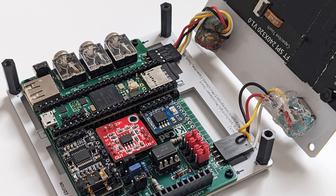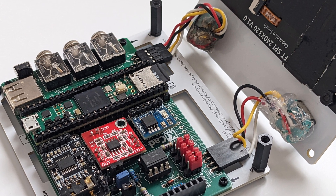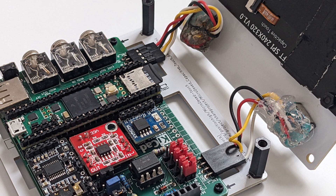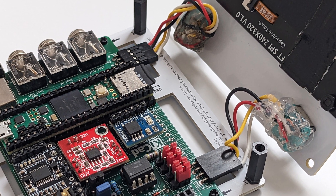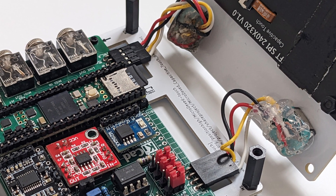Connect the encoders to the Microdexed PCB. Be careful to not reverse pin directions of any connector. The pins on the Microdexed side are labeled on top and also on the bottom side of the PCB. As a test, verify that the ground pin goes indeed to the corresponding pin.